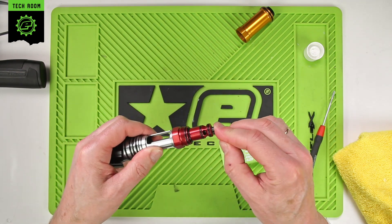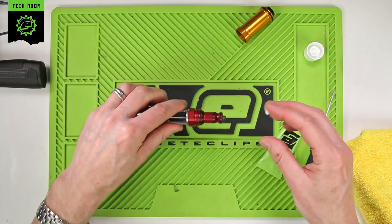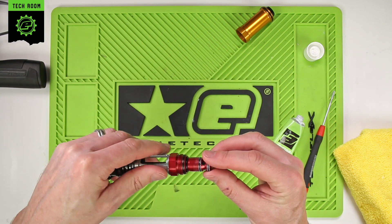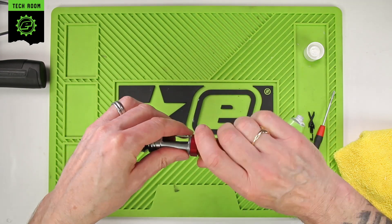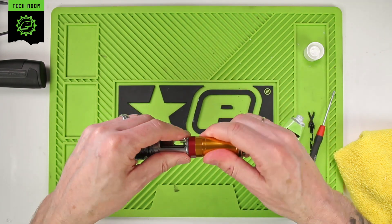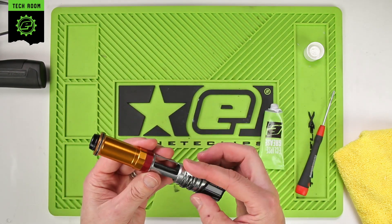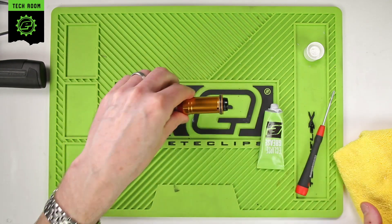Check that it's working by pushing on the end of the spool. Then, just like before, apply a small amount of grease on the two number 13 O-rings on the bolt guide. Then put the cannon bolt back on, again screwing until it stops — don't crank these together, just screw until it stops. Then apply a small amount of grease on the external O-rings just to help it slide back into the body smoothly.